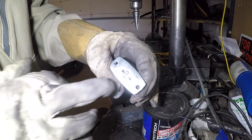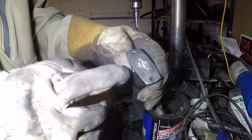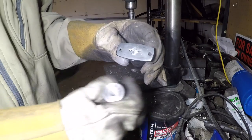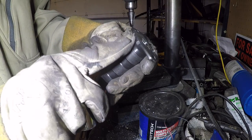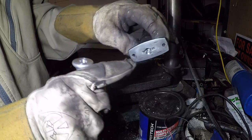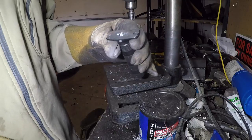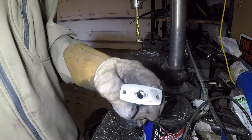We're going to try and get a notch into the center here and then drill a hole dead center the same size as our original shifter. You can see that's pretty close — close enough for what we're going to be doing — but I'm going to go ahead and get this hole as big as the other shifter. Probably going to use the lock screw to hold it on for now. I can also thread it later — I believe I have this tap and die set. Grind this a little smooth and then paint it.